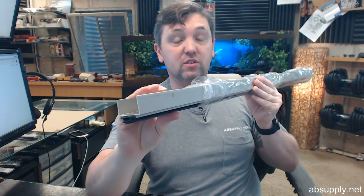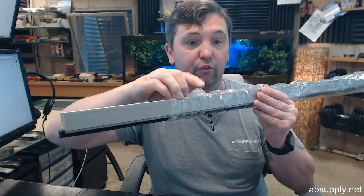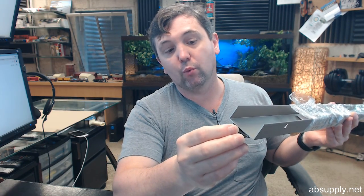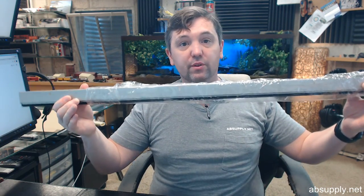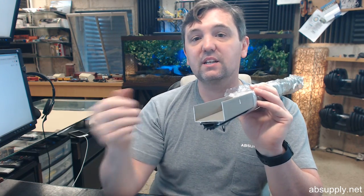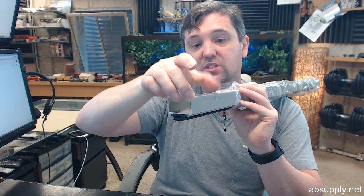The reasoning is this: if you had to take a standard 36 inch piece and cut it down to say 32, you are going to eliminate that first slotted hole — the second one is over here. Screws are included in the complementary finish, but you would be stuck cutting it and then drilling a hole, which you don't want to do because it is difficult to drill a slotted hole. That slotted hole is going to help tailor this on the bottom of the door if you have a sill that is not level, a jamb that is not plumb, or a door with some warp. So indicate in the comment field the net size you need and we will happily trim everything to length, placing the first slotted hole at the proper distance from the edge and the proper center to center.